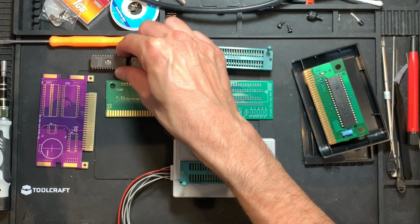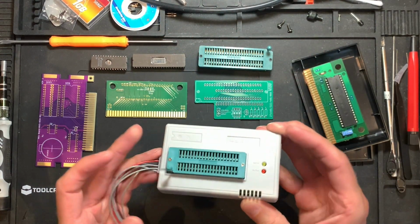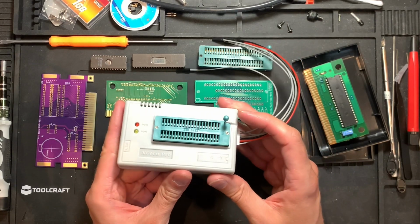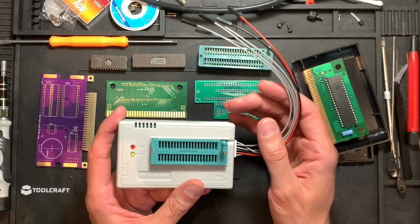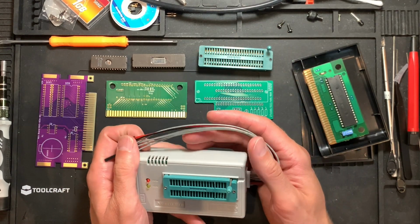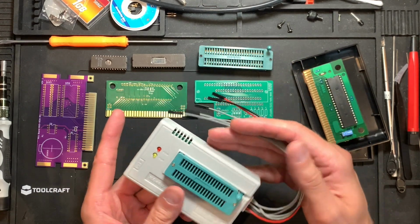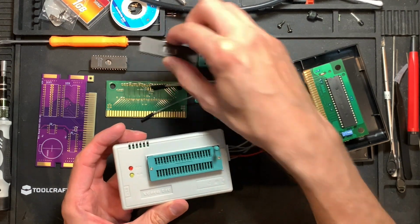So these I freshly erased, and we also have to program them, and you usually do this with one of those cheap TL866II Plus programmers, which are very common and available. They are knockoffs, but this is already a Chinese product, which is relatively cheap. Programmers can be had for multiple hundreds of euros, like the Galep 3 that I already showed on this channel. I could also use that, but this one here is more modern. I can use my iMac to program the EPROMs, and it's supported by the open source MiniPro software, which is excellent. But it has one problem, of course.